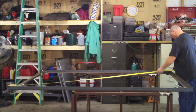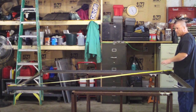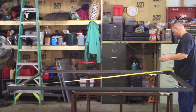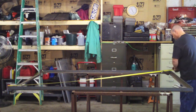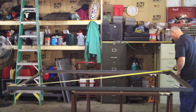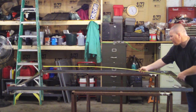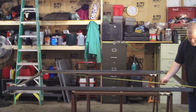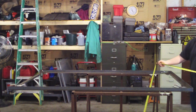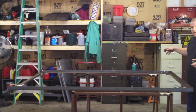I've got it hooked, and I've got 114 and 5/8 inches — so it's a little different. What I want to do is squeeze these two sides together and split the difference. From 5/8 to 7/16, that's only 3/16 of an inch. I'm going to knock this, and I'm down to a half — a little less than a half. Now I double-check this side, and I've got 114 and a little less than a half. It's perfect right now, so I don't want to mess it up. I'll show you a trick on how I tack this, and then you double-check in between tacking.